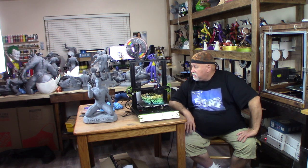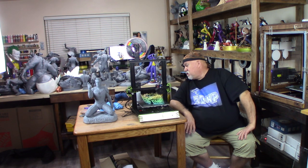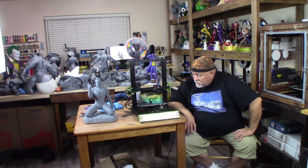And let's see, the spool holder is off an Ender 3 that I have laying around. I didn't print out the one that's on the file, and obviously I needed one right away to work with. On the lead screw stepper motor, I did not have to use a spacer. Everything worked out fine. The gantry goes all the way top to bottom. It's lined up nice and straight, so I did not have to add any kind of spacers or washers to make that work.